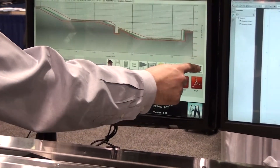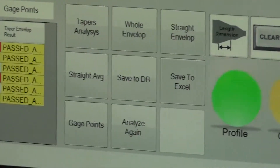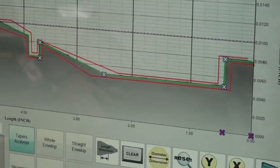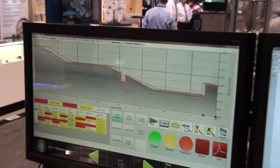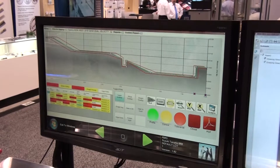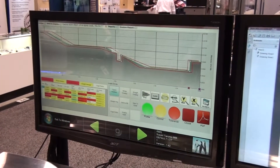The new gauge system has enhanced analysis features including automatic wire analysis with no need for the operator to pick intersections or find gauge points, save analysis without printing, and pass/fail in the measurement summary file. You can choose the analysis option for each recipe including absolute or incremental lengths, no arrows, algorithm A, B, or C, whole wire envelope, flats envelope, and flats average diameter.